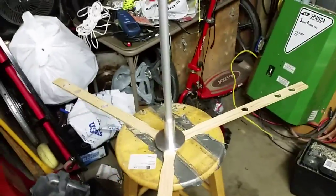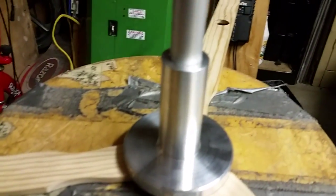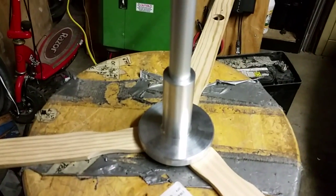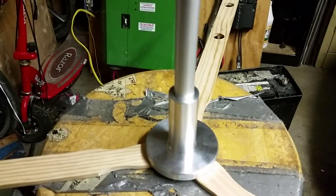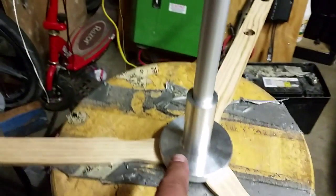I suppose I could just put all mounting holes there, but this is so big in this tiny garage that it'll probably whack me as it's trying to spin. Plus it's more mass — I want to keep it as light as possible. That part isn't that light, but it has to make and break all the torque, it's got to do everything. So I made it out of aluminum — took a lot more time and material, but it needs set screws and stuff.